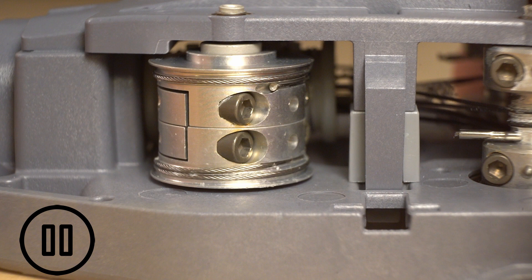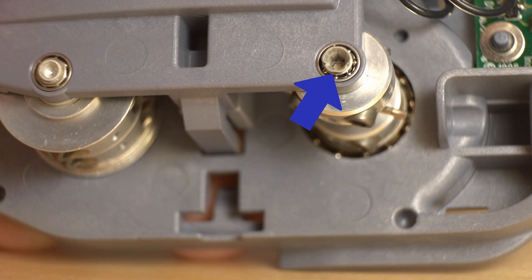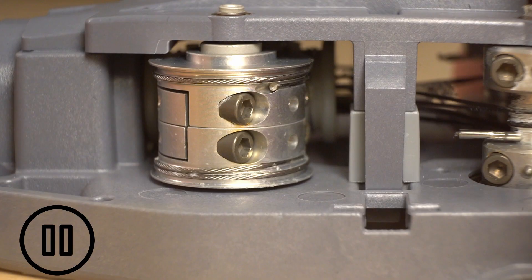Let's take a look at how the pulleys are constructed. Looking at the pulley that twists the whole shaft: at the top there's a very small bearing pressed into the plastic, held in place and preloaded by the aluminum shaft itself, which is swaged over the bearing to permanently hold it without any fasteners. There are two separate pulleys per axis because there are two separate cables - one winds up while the other unwinds. The pulleys can be rotated relative to each other to tension the cables, and you can see they're clocked slightly off from each other. The pulleys have split housings with screws that clamp on the shaft, and the cables are threaded through a hole and held with a crimped ferrule - a tube you crimp over a wire cable.